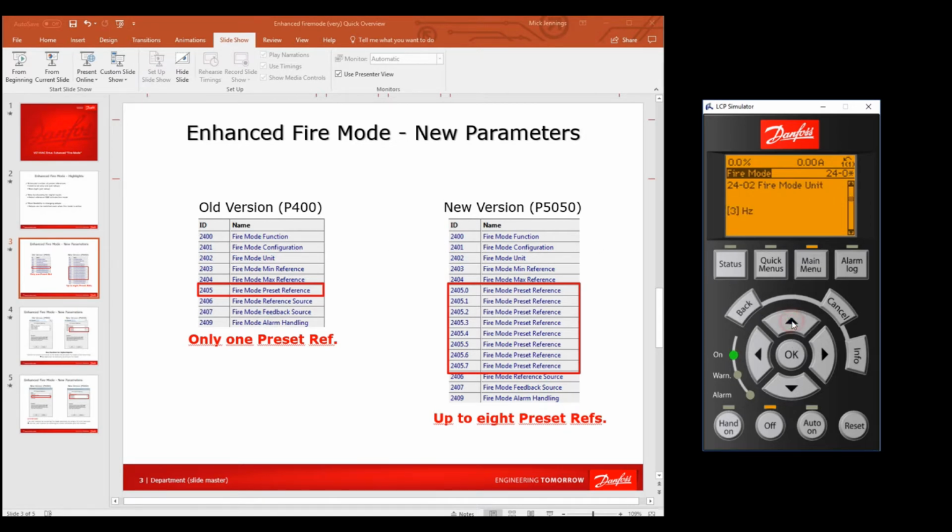Just this other thing to mention about this open loop and closed loop thing. You can choose whether you're in open loop or closed loop, and closed loop control normally means that you've got some kind of feedback saying what the pressure is you're running at or whatever, so you want to run in terms of pressure. So I just wanted to point that out really.